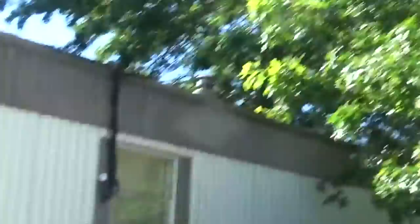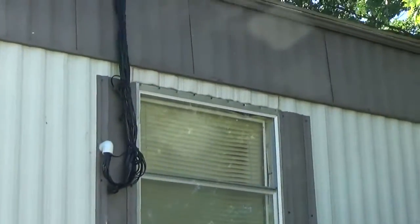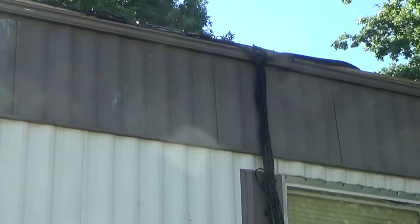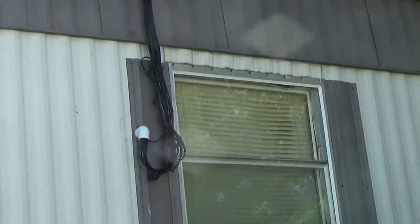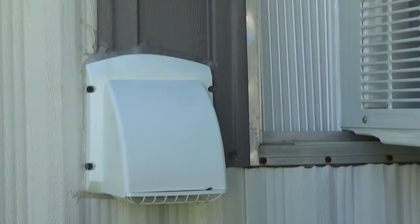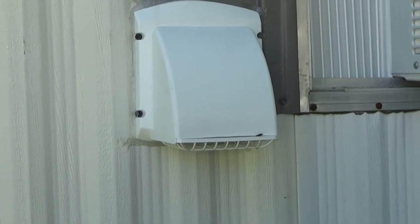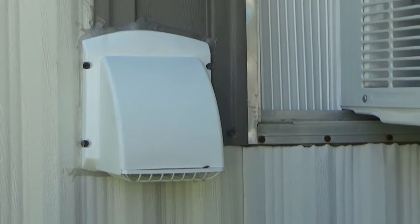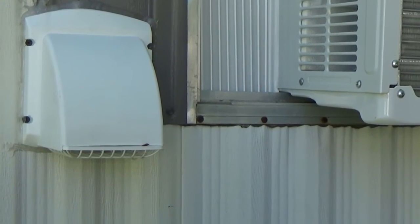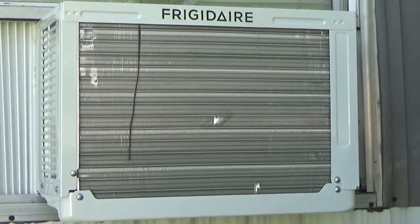All those panels are tied in together. I have wired it up as a 24-volt solar panel system. My battery bank is 12 volts, but they come into an MPPT controller which converts the 24 volts to 12 volts. The wires come down here and go through the wall. This right here is a little vent system I designed and built — when the battery voltage gets over 13.8 volts the batteries start off-gassing, so a fan kicks on inside my battery box and exhausts the air outside.